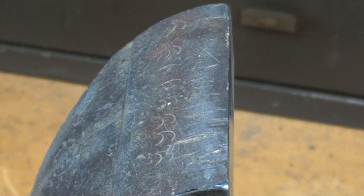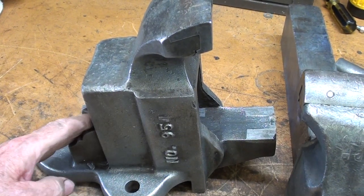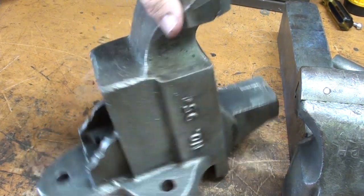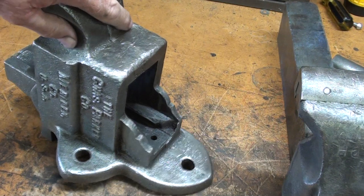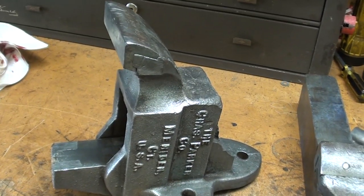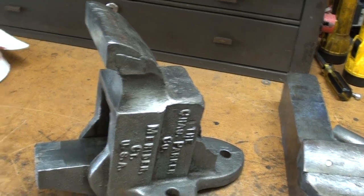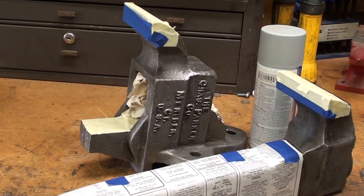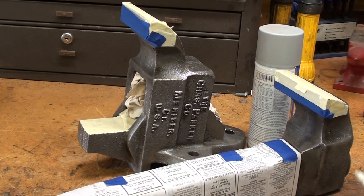I think I have done a real good job of removing all of the paint. Like I said, I didn't intend to. I have already degreased it off-camera, and I'm ready to go ahead and mask it, then spray it with primer, and then with a finish coat. So I won't show you the masking — that's pretty boring stuff. This shows up real nice now, doesn't it? The castings are degreased and masked off, ready to go, and I'm going to apply a coat of Kmart gray primer.